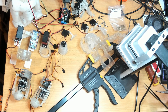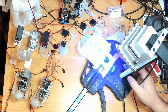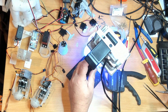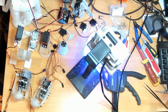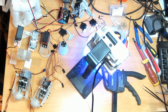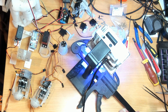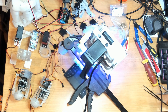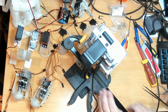Whatever you do with these UV floodlights, don't look into them — they will cause the equivalent of arc blindness. Anyone who's done a lot of welding will be familiar with the feeling of arc blindness. Don't forget when you're curing, make sure you cure both sides. I'll let this cure for around 10 minutes. Okay, that'll do — it's all dry now.